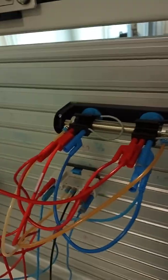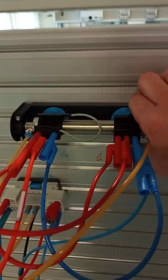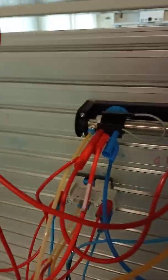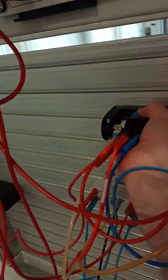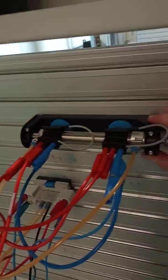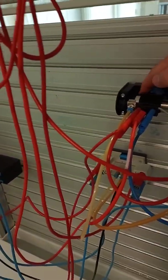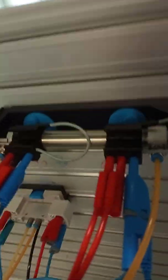I would look at the condition of the equipment — is the cylinder fixed in position? If it had been running for a long time, we might find it's slightly loose. If I loosen this off just so you can see, you can see it's moving — and that is not a good idea. That would be one of the first things to repair: just make sure everything is tight. The reed switches and their cables look in good condition.